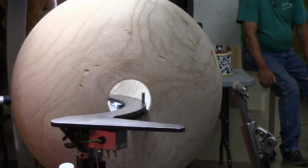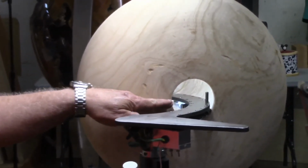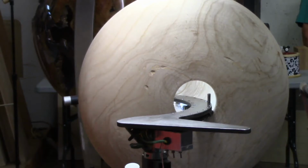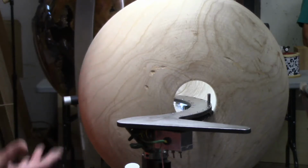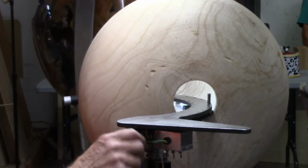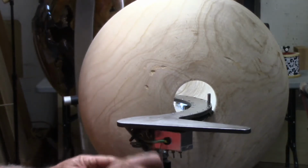Actually, on my lathe at home, it's up high like this. My spindle height is 54 inches off the ground. Well, that's ridiculous as far as doing outside work. You can't do that. So it's on some big 2x8s, and so I'm standing on a platform. On this side of it, I'm at the normal 42 inches or so, a normal person height lathe. But then I step off, and I'm at 52, and you'll see the reason in just a second. So let's see this. I guess we can tighten it up.